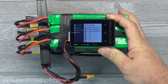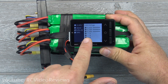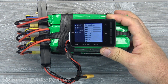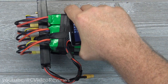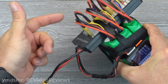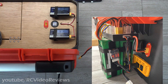If you know anything about parallel charging or if you've watched my videos, you'll understand what this is. This is six three-cell packs wired in parallel connected to a parallel board. This took me literally five or six minutes to do, and right now I've got a 31,200 milliamp hour pack that can deliver 300 amps. There are some caveats to that — I wouldn't try to run 300 amps on this setup as built, but that's not what I've built it for. I'm just telling you what it's capable of doing.